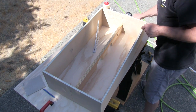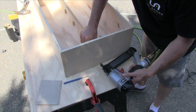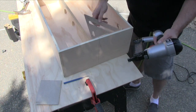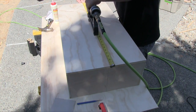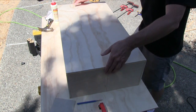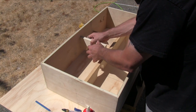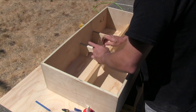Now I'm using a pneumatic nail gun with one-inch brad nails to nail this off. I'm using my speed square to double-check that it's perfectly perpendicular. You can see how nice that line is — it gives me an immediate reference. I have a small mark that denotes the top of that three-quarter-inch plywood strip so I don't shoot over it. Now I'm flipping it over and using a tape measure as a guide between my two marks, leaving a little bit of space for the head of the nail gun to drive a brad in the back for extra stability. The workhorse here is really the wood glue — once it dries, none of these pieces are going anywhere. I'm making the cross pieces now, did a dry fit, then added glue, and I'll continue this process throughout.